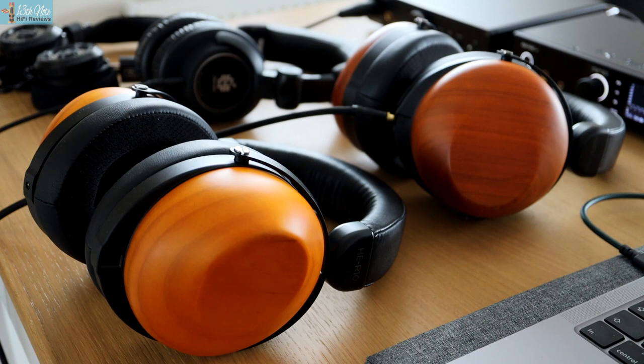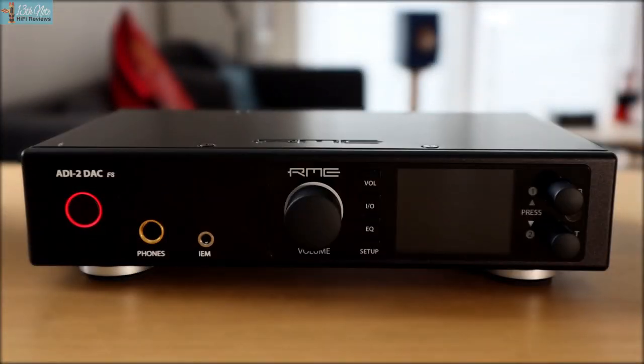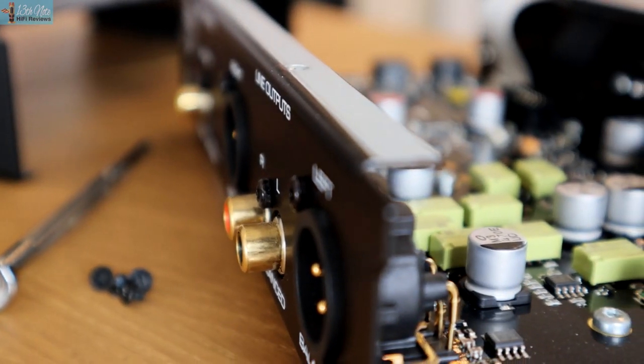So all these headphones aren't that demanding to drive, and possibly I'm not really maxing or challenging this SMSL, but just using the RME alone, comparatively, there's a rawness in tone which is reflected into the headphones, not as a DAC itself, but its headphone output. And with this SMSL amplifier, with double the RME's output power, and considering things like distortion and crosstalk, amongst a whole host of other interacting factors, is in all likelihood accounting why the SMSL clearly sounds the better amp, using its headphone out rather than the RME's.